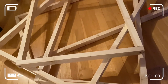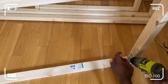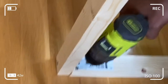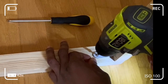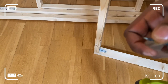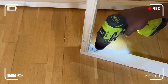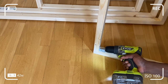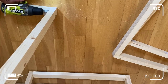That's pretty much all of your acoustic panel's long and short sides coupled together. The next step is to install four corner brackets on all four corners of the frame. Pilot drill the holes before you screw down the brackets. When pilot drilling, you can place tape around the drill bit so that you do not drill past the length of the screw. Put masking tape up to about three-quarters or half the screw length so you don't pilot through the wood onto the other side — the tape serves as a gauge for when to stop.